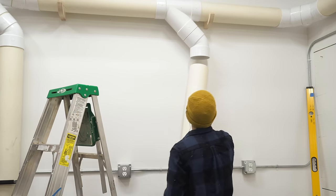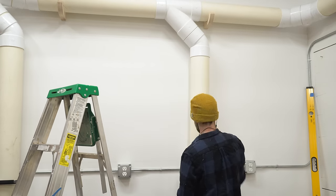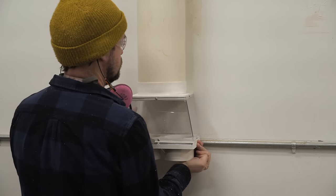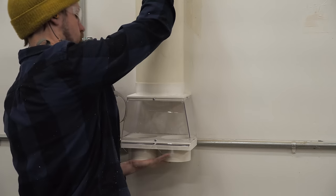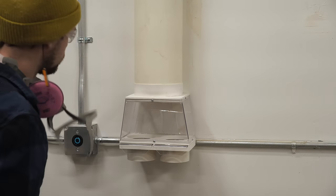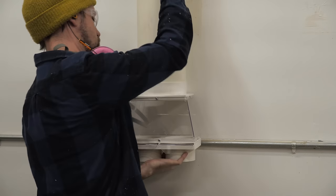The second and third drop are exactly the same — they are a 45 degree fitting down to a pipe which gets a splitter on the end of it. These splitters are sold by Clearview Cyclones. They divide a six inch port into two four inch ports and already have blast gates installed on them.